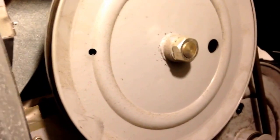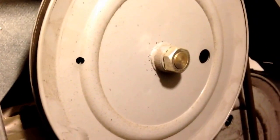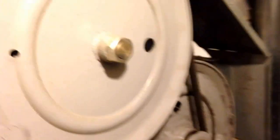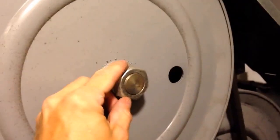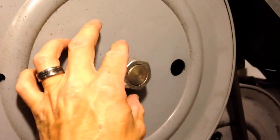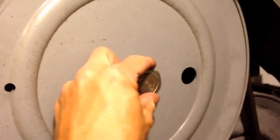I had a problem once before where I had to get that pulley off — I forget just what it was, a bearing or something back in there. So I had to get that pulley off and this is what I needed to do it. They're fairly inexpensive from Harbor Freight, and if you ever want to do any real maintenance on these you're going to need it. On the newer ones, it's a pressed-on pulley so you're going to need a gear puller to get it off. But on this one, you just pull that nut off and we'll get into that ductwork.